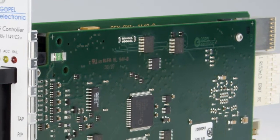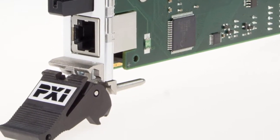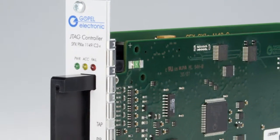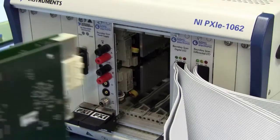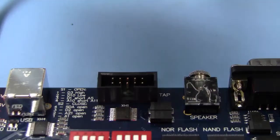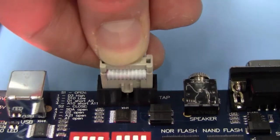The new controller based on PXI Express forms part of the ScanFlex family seamlessly. An additional TAP transceiver is not necessary as it is already included on the board. The controller is available in 9 different configurations which differentiate the performance and quantity of TAPs.